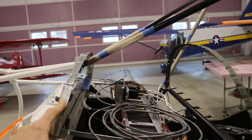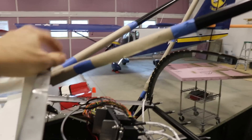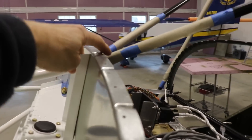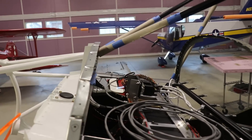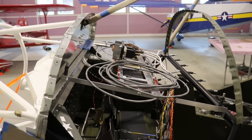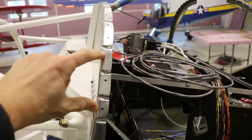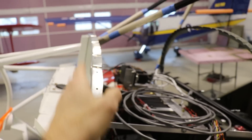So what I'd recommend — if you guys are building any of the 750s — you might want to have your engine mount and frame all finished and bolted together before you do work on your glare shield. Because when these two meet here, it may or may not move the top of your firewall slightly. Since these holes didn't line up on my new glare shield, I still have extra material. The first three holes on both sides still lined up perfect; it was just going further around that they were off.